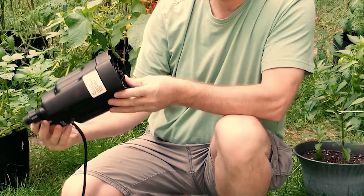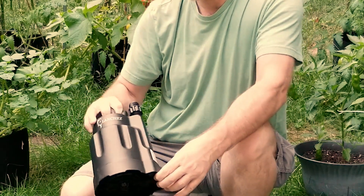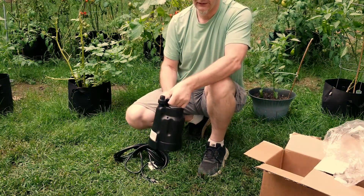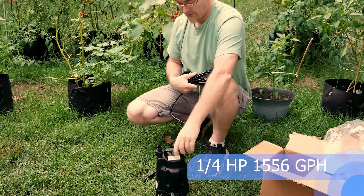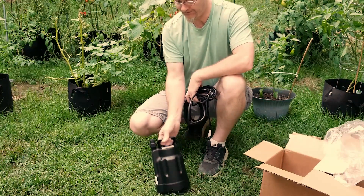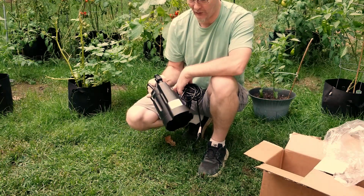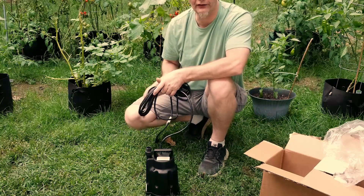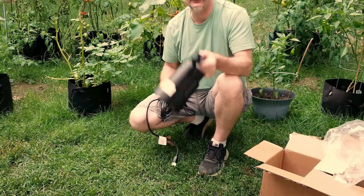Looks like it takes water in on the bottom. Must have some sort of a sensor. It has a garden hose type outlet at the top. They said this thing does 1556 gallons per hour. It will work for your basement, it will work for your swimming pool. It does lose quite a lot of power depending on how far up it has to push the water — I think they all do. So the shorter the distance you're pushing it the better it's going to work. This is a quarter horsepower. We'll be back with a little demonstration of this in a minute.